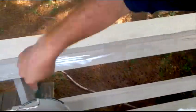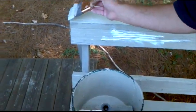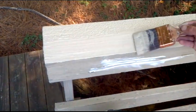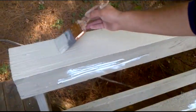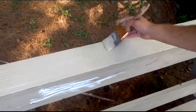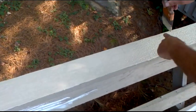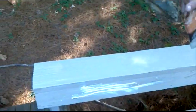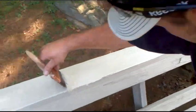Now we have the covers with that, and this is where you get your finish coat. Always keep your brush wet. You want to pull in the same direction — I'm not even putting any pressure on the brush, I'm just dragging it. Always go the same direction. You can start in the middle, fill in what you missed where the texture didn't get good, but now you're going to pull back into your stroke. It creates no gaps, no rises by pulling back in.